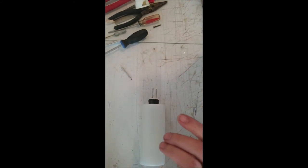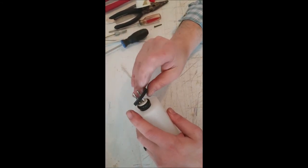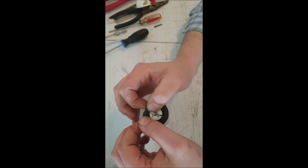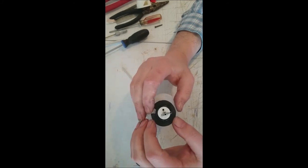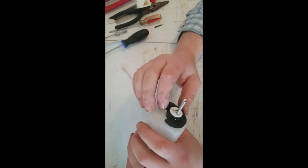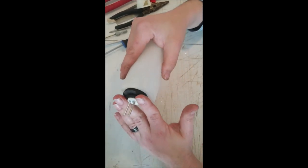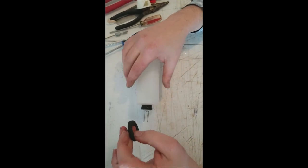Now, this kit came with a foam ring to put around here to insulate that when it's up against the firewall, because you notice when we mounted our motor, that one split. It's so darn old it split. It's all right, it happens. They don't really have to have it, but this sets up against the firewall. That helps isolate vibration from the fuel line.